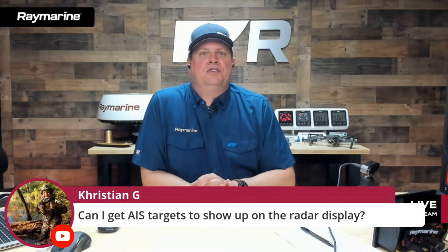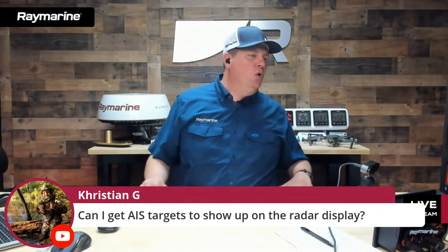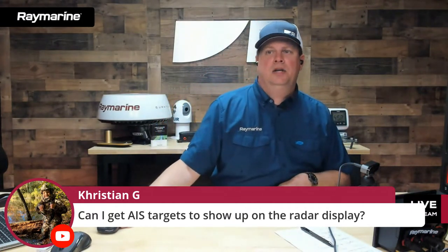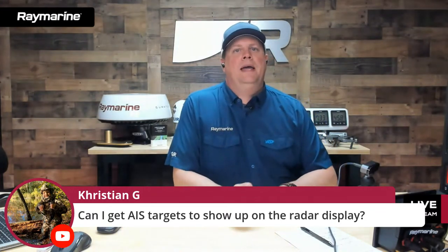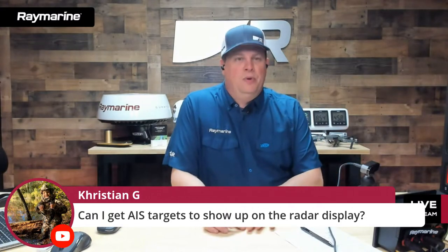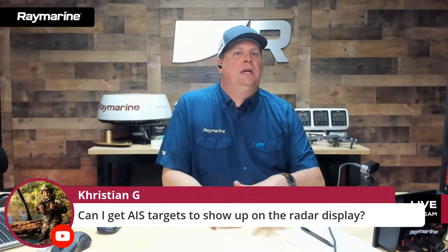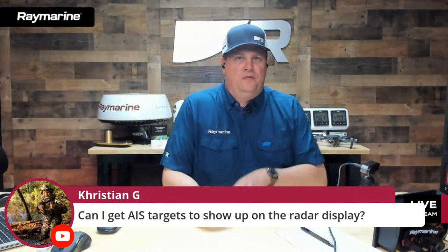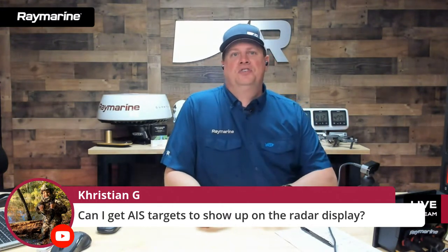Christian, can I get AIS targets to show up on the radar display? Yes, you can. So to get AIS on your Axiom display, you do need to have either an AIS receiver or an AIS transceiver. You also could do it with a VHF radio that has onboard AIS. So something like our Ray 73, our Ray 91 radios, they have AIS receivers built in, so they do dual function. But assuming you have one of those devices networked to your system.